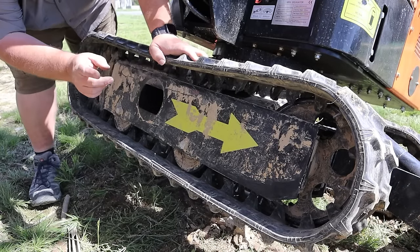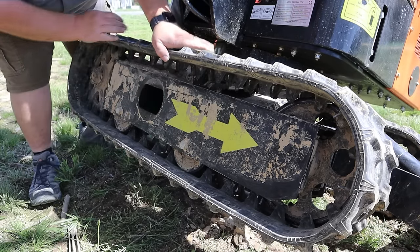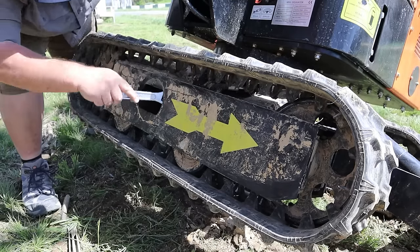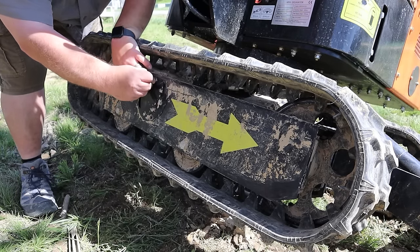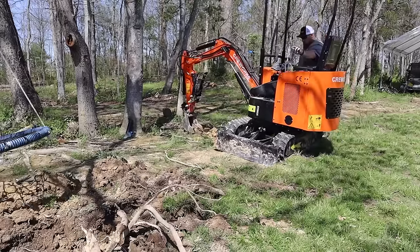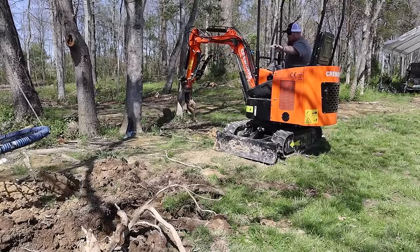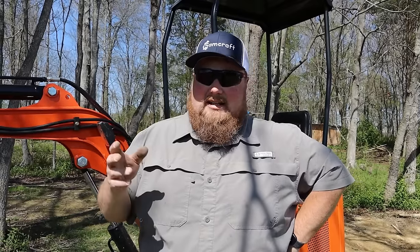The track is back on and tightened up. We're going to turn off the machine so you can hear us. Now I'm going to tighten this jam nut down and get it as tight as I can with the adjustable wrench. Last thing to do is put your cover back on with your 10mm bolts and get back to work. The thing that made it difficult for us was I loosened that bolt by hand until I felt like it stopped, and assumed that was good enough. In reality, it needed to go back another couple of inches. So don't be scared — back that thing way out, hit the idler wheel with a hammer, and really get it out of the way. It'll save you a lot of time and frustration.